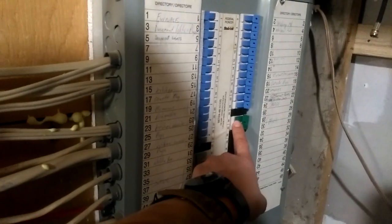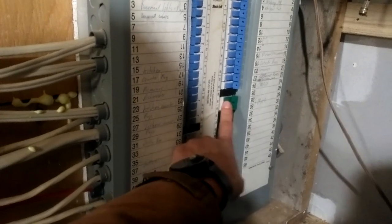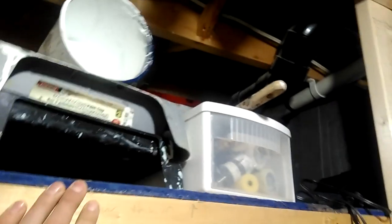I've already determined there's space on my panel — this is beside the dryer 30 amp breaker, so that's where mine's going to go. My cable's going to run out here, up along there, up to the ceiling, and across. I'm just going to follow this central vac line out through that rim joist and out into the garage.